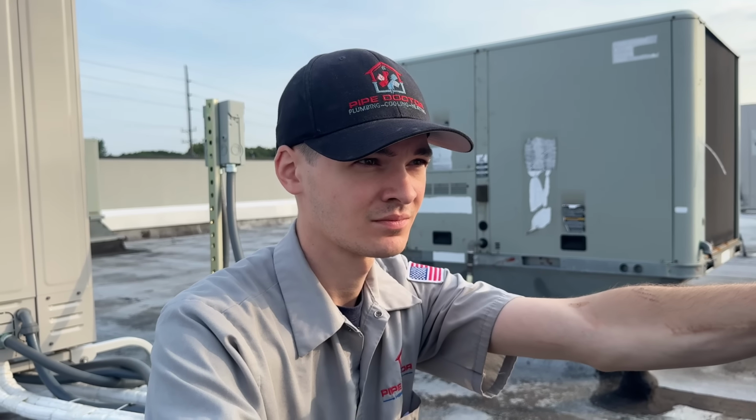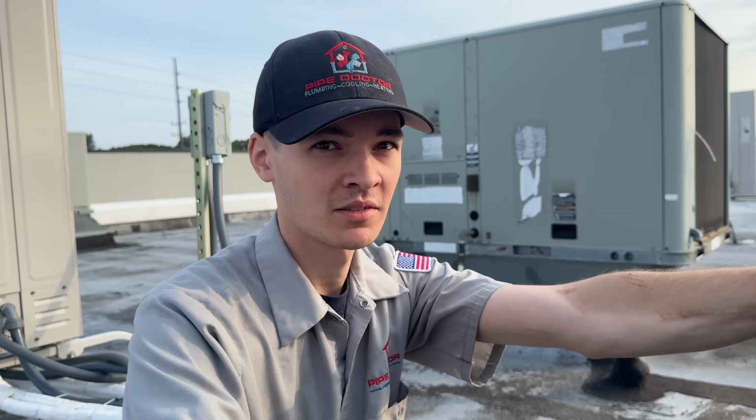Daniel, what does that tell you when you see bubbling refrigerant in your sight glass? I don't know. You don't know? Really? Oh, let's use Google and find out, ladies and gentlemen. So if you Google why are there bubbles in my AC unit sight glass, the number one response is that it's indicative of a system refrigerant leak. But that isn't always necessarily the case. There are other reasons for bubbles in your sight glass.